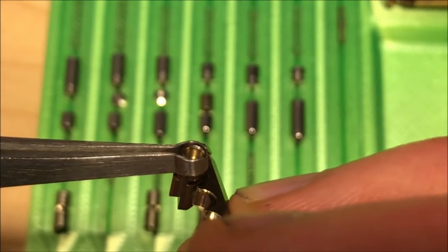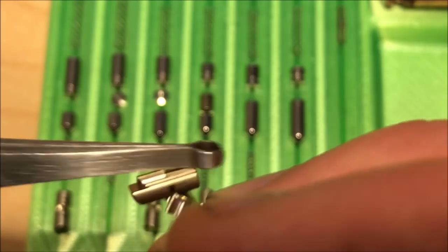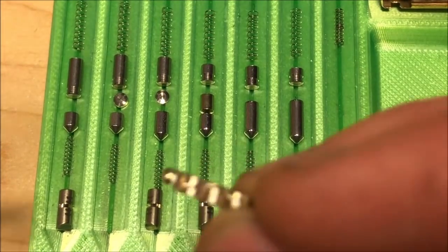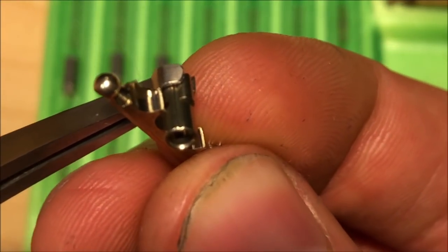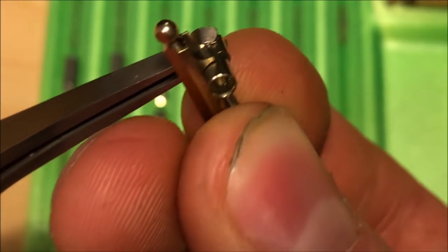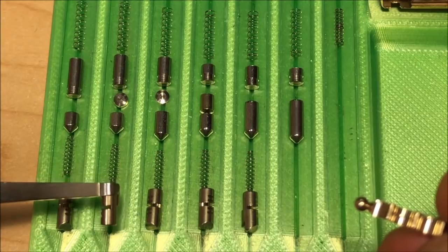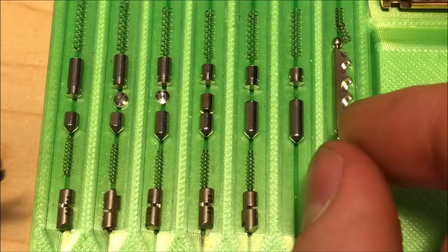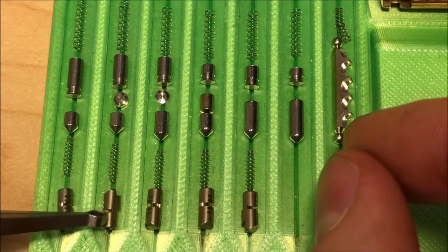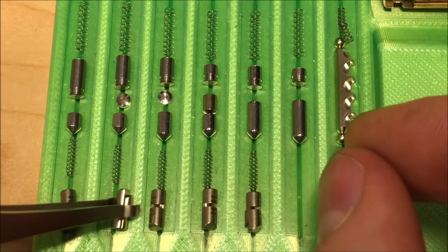It's hard to get them to align outside the lock. As soon as you get to that true gate, it will recede far enough for the lock to be able to open — far enough meaning it will sit flush with the finger pin. So this would be an open position; we are in a true gate there. As I mentioned, all of these finger pins are the same: a true gate in the middle with two false gates on either side. This one is upside down so it is not quite the same.